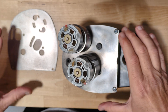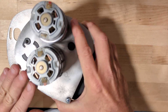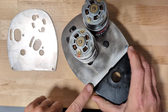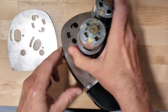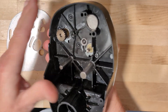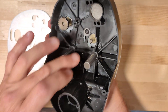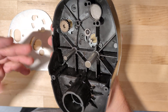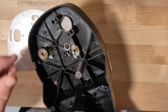The way that these work is it's a plate that bolts onto the back of your gearbox. Your gearbox already has two holes in the bottom — you're going to bolt the plate onto the existing gearbox, remove all the gears from inside the gearbox, and clean out all the grease first. You don't want to have grease covered with plastic shavings, as it makes it a lot harder to clean out later. So clean all the grease out first.